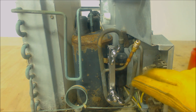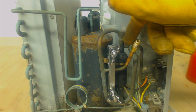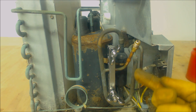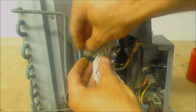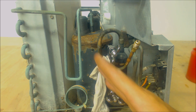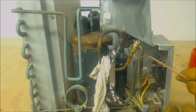It's very important to think about where you're going to end up brazing this ahead of time, and basically your flame placement. I could point it up this way, I could point it down this way, I could always end up pointing it down this way as well. So for now I'm just going to start going straight up — I'm going to heat up my inner tube, and once that's heated up I'm going to back up into my swedge and pull all the braze upwards. This is a big heat sink so I'm going to put a wet rag behind it. That takes care of that old joint back there. This is kind of the same procedure as a system with a service valve — the service valve is holding all the refrigerant back, and once you braze it and then pressure test it, there's no way to add nitrogen while brazing. I'm going to bend my braze rod right here at the tip so I can get around it.